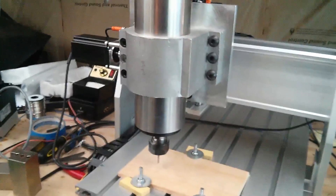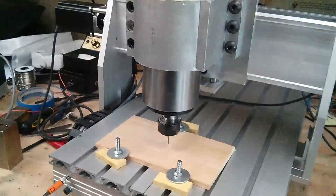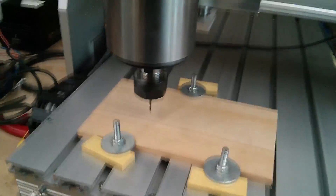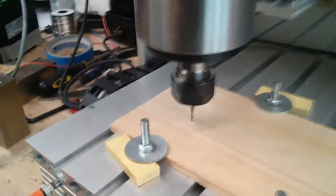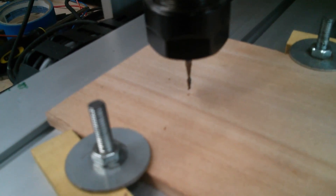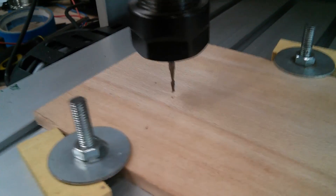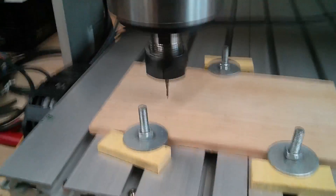I've jogged it around a little bit and it all seems to work — it doesn't have any problem moving the motor around. We're gonna try going to zero here. I set zero down below the board because I believe that's the way the code is set up. It looks like it's engraving basically right at zero so I want it to run into the boards. This is why you use cheap replaceable bits to begin with, because you're inevitably going to break them.